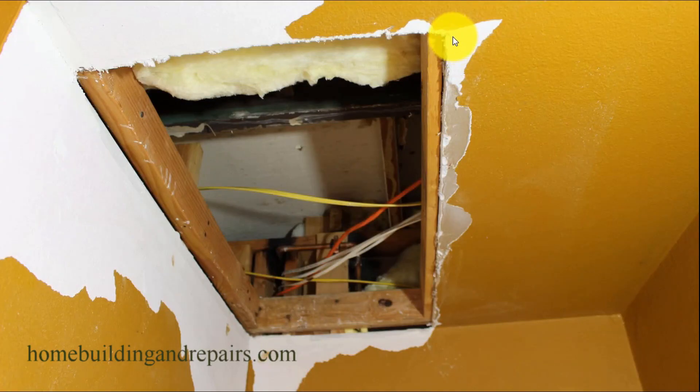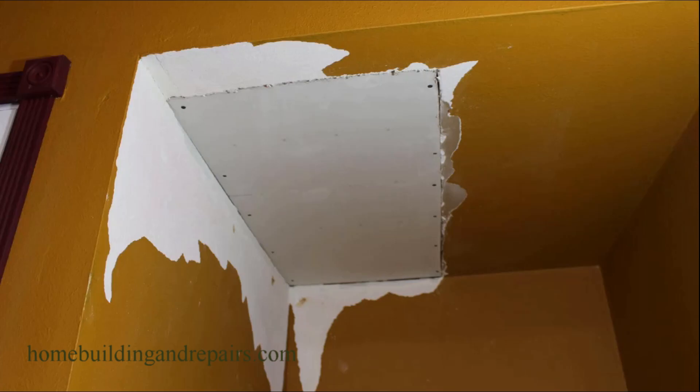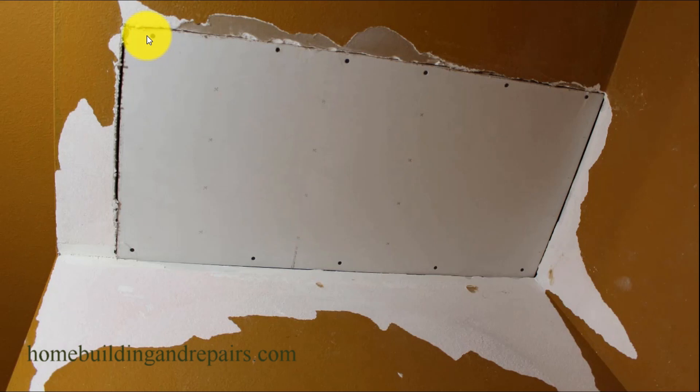Some people might want to cut half on the joist — knock yourself out to get your backing there. Put the insulation back in, then the drywall, and then screws. For building code, I believe it's seven inches on center for the ceiling. I doubt these are exactly seven inches apart, but it's fine how I have it here. Maybe one other screw there would have been good.